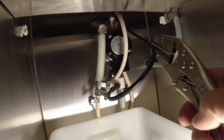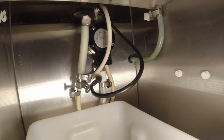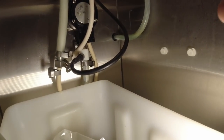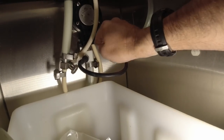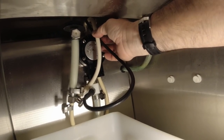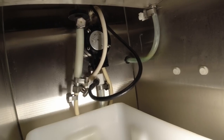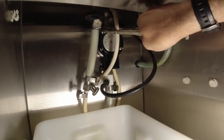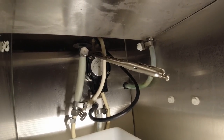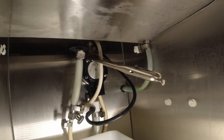This pump mechanism on the center sucks the mix up out of this bag, goes through there and pushes it up into the barrel. At the same time, that little pump on the back is pumping air and cramming it in. This could be under 25 pounds of pressure, so to make sure we're not getting zapped with a load of mix, we're going to clamp that off and get that switch undone — otherwise that mix is going to come flying back at us.